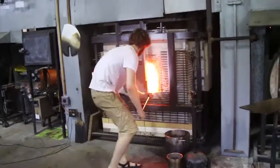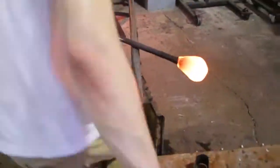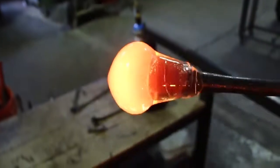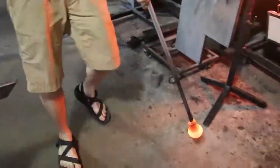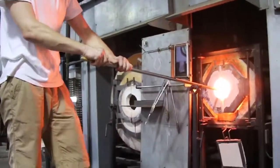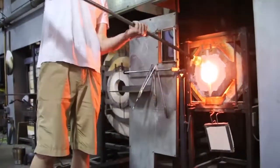That's the new element we're introducing, but you didn't get a great look at what I was actually doing with my body. So we're going to do another run-through with a different camera angle so you can actually see what's happening. Big thanks to Sean Bradley for doing all the camera work on these videos. We're going to run this one forward from the very top — the first gather — just so you can see the whole process, but at triple speed. One gather, quick block, squat it up, shoot the bubble just to have something to drop out. Then we join up with the last demonstration, going right in for a heat. Coming out, holding it down.